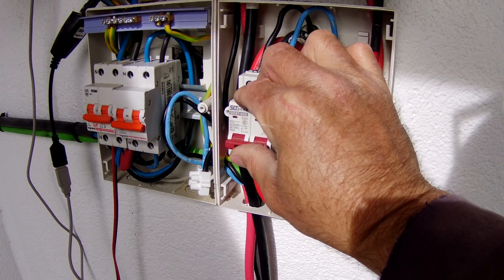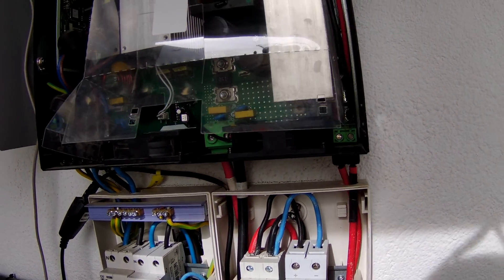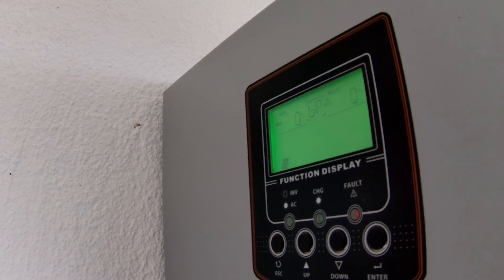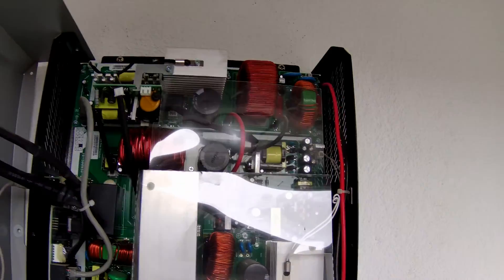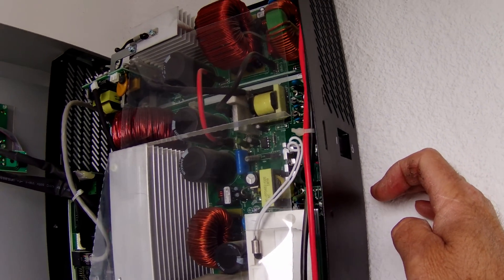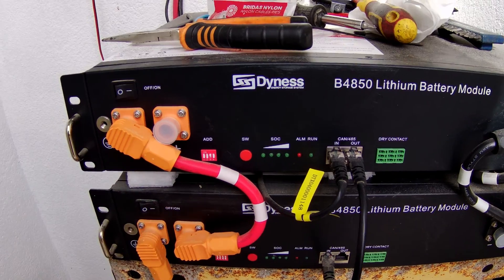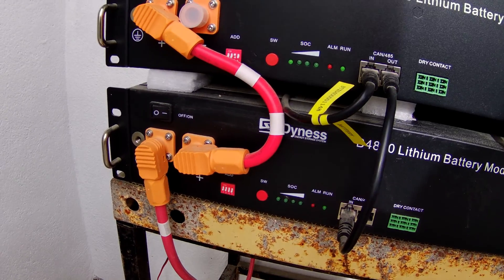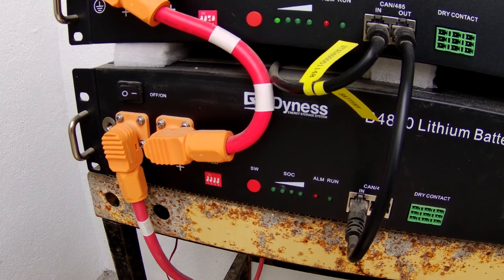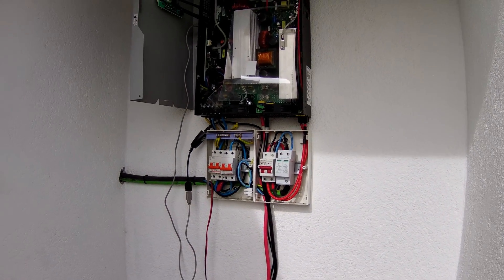Here we go - I'm going to stick the solar panels on first. Our fan's starting up straight away and it's not as noisy as it was before. We should get a beep in a minute... ah, there we go, and that should stop - so that's not a constant beeping. Now we'll switch the inverter on. Beep again - it should stop. And now I'm going to switch the batteries on. Let's see if they're charging. We can hear some clicking coming from the inverter, and there we can see it - the lights are flashing on and off. For people who aren't familiar with solar panels, that means the batteries are charging. So that's fixed.